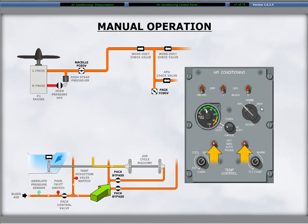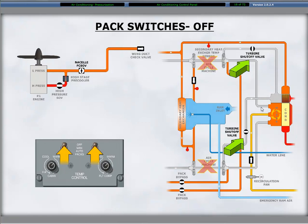The manual position uses the ECU analog channels which control only the pack bypass valves in response to the manual inputs for cabin and flight compartment temperatures. In the manual operation mode, the flow control shutoff valves remain in a full open configuration because the engine high pressure bleed ports remain closed with the analog channel controlling. Placing both pack switches in the off position results in the ECU closing the flow control shutoff valves, the turbine shutoff valves, and shutting down both ACMs.